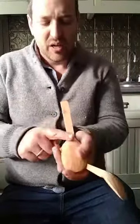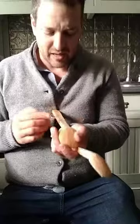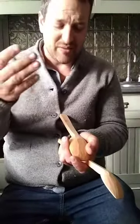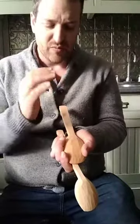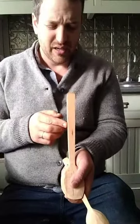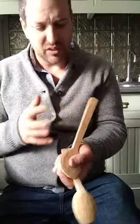Now, each of these handles is going to be slightly different, although you'll see me basically approach them in the same way, which is to knock off a corner and then knock off the sides of each plane that then gets created. What I found is that it feels the best in the hand because you still have facets, but it's very easy to adjust something because the facets aren't fussy. Having lots of parallel facets that create a rounded surface that is relatively organic, relatively geometrical, somewhere in between the two, gives me the chance to most quickly achieve something that feels deliberate.